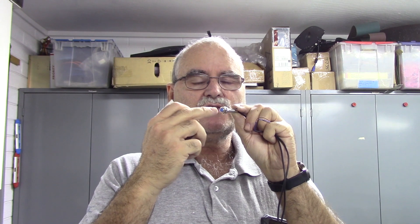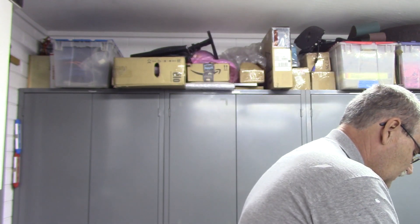With this machine I have to use reference marks. I'm going to move the carriage all the way to the Z-plus end and the X-plus end of their travels and put a reference mark on each axis. That allows the user to jog the machine to those marks roughly, then press cycle start to home. The pulley will turn and as soon as the magnet passes in front of the sensor it will set home. Without reference marks, every rotation that magnet comes around it can trip the sensor, so the reference marks are essential — it's called homing to reference marks.